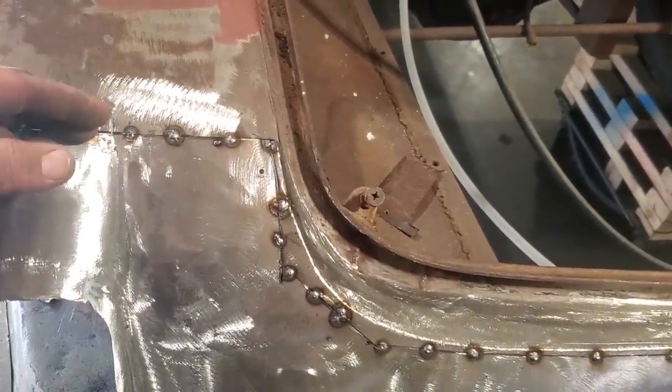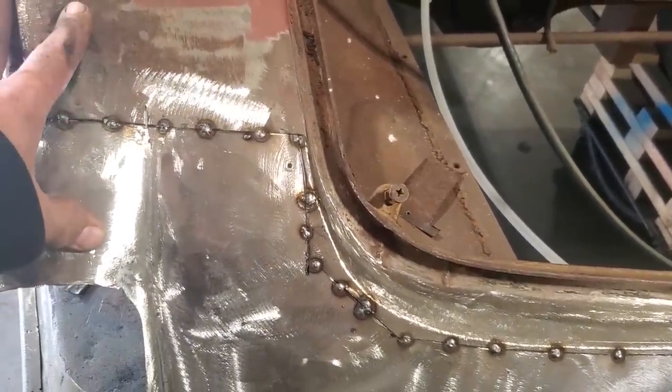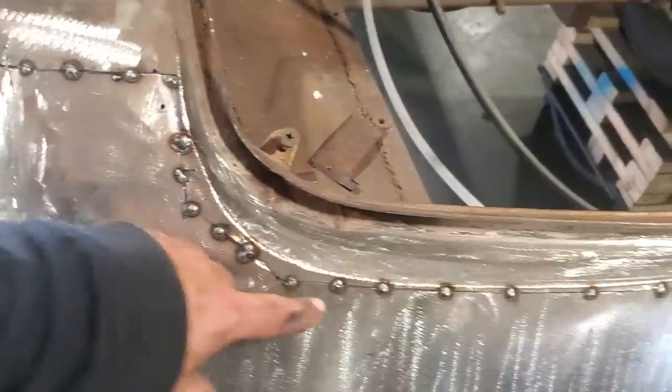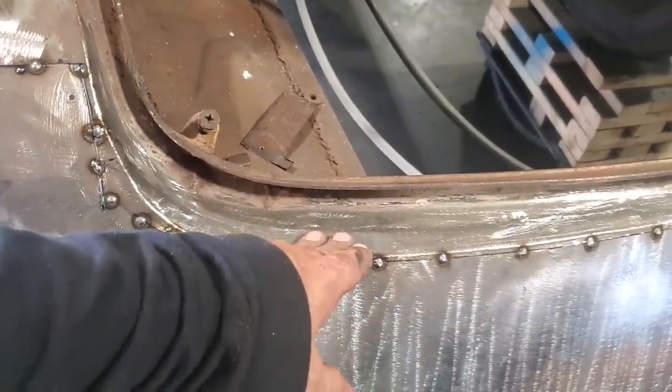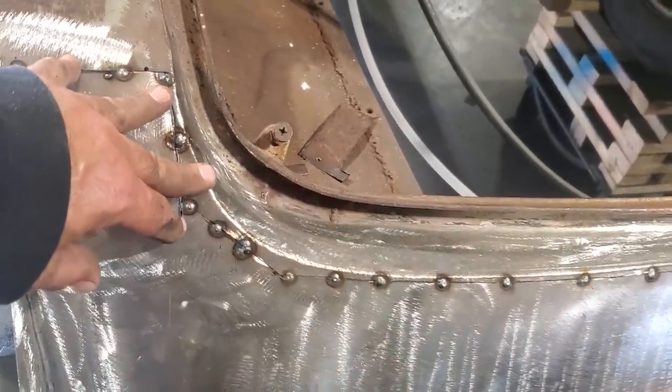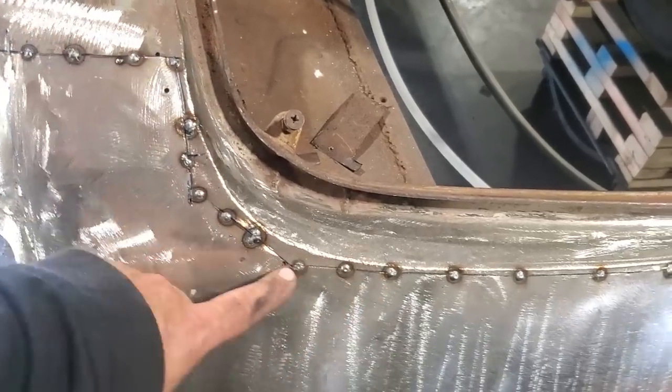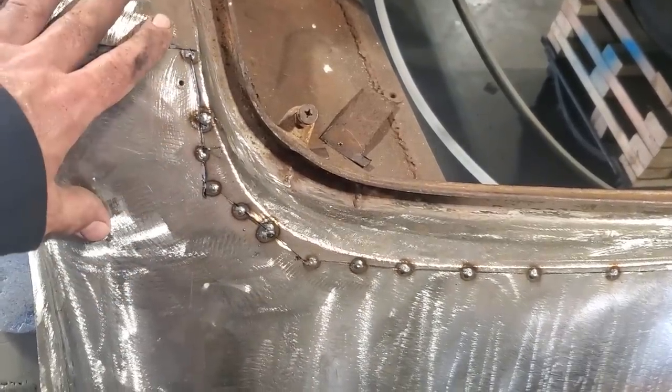There's only a few places on a car that's like that, rocker panels, some sections in a roof. Usually I'll make a boat of it. I'll cut a section of it so it cuts to fit. And then I'll have an overlap in a spot where I can get at it, so that way I've got something to lay against and I'll cut it out after the fact. But like these straight corners here, it's never an issue for me.